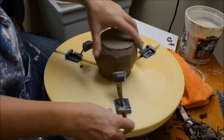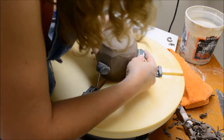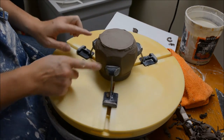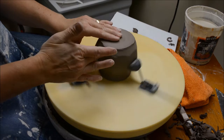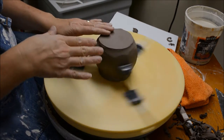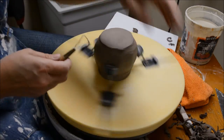Now I'm going to tighten this up. The trick with something that's faceted like this — you've got to watch out because you're going to probably hit the facets or the corners occasionally. So I'm trying not to squish it too badly. As you begin to rotate it, just make sure it looks like it's pretty much in the center. If you're on a corner, weirdly, it can kind of shove it over and it can be quite off center.